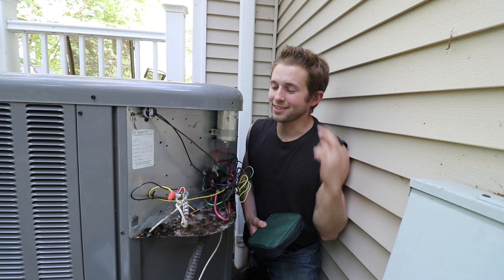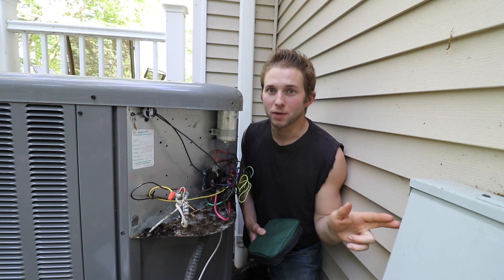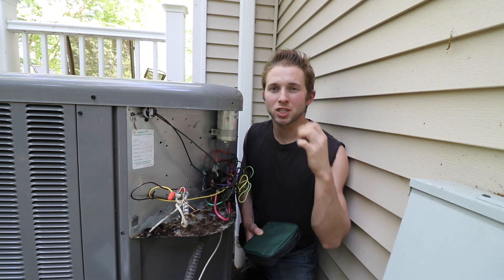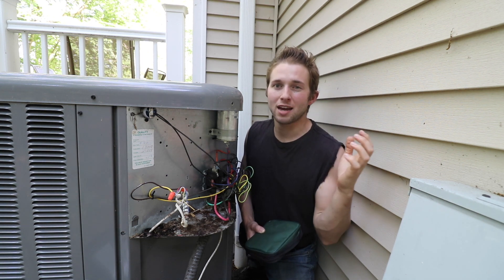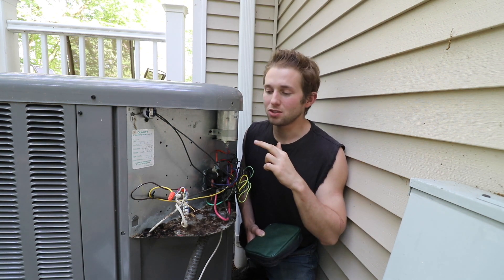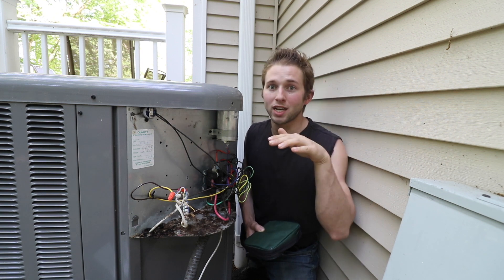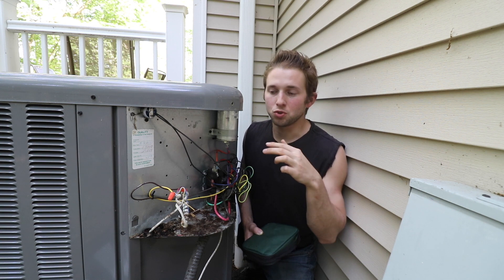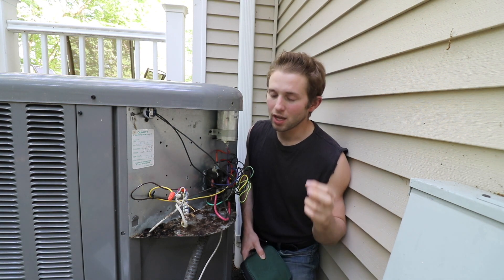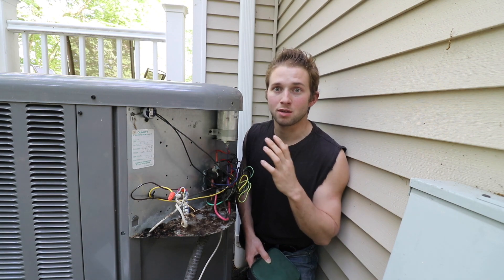After realizing it was not related to the capacitor, I turned the breaker back on, understanding that I need to be careful now because this is live. I went in the house and turned the thermostat down so it was calling for this unit to turn on. There are two signal wires that feed into this unit — when the thermostat goes below the set point it sends an electrical current through those wires. I started probing around with my voltage tester and found I had 230 volts coming in and the signal wires were signaling for the unit to come on.